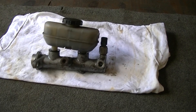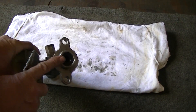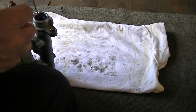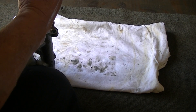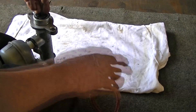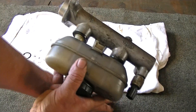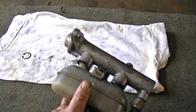Alright, enough rambling on. Let's go ahead and tear this apart. Usually they're pretty easy to get apart. I've got a little clip here I have to take out. There's usually a little bit of pressure here, so I'll take my screwdriver and push down on this, then take my needle nose and take this little clip out. Sometimes it's spring-loaded and the spring might pop out and force the clip flying into the air, but usually it's not. I think more than likely a seal has gone bad and torn.